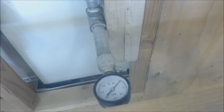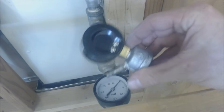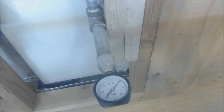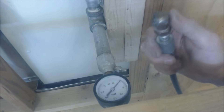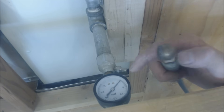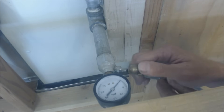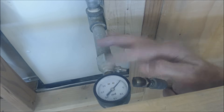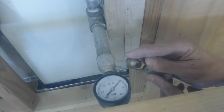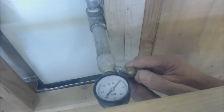Here's what one style of pressure test gauge looks like, and here's a different style. We're going to go ahead and put pressure in and see what happens. When adding air, have the air meter set down at the regulator on your air compressor — run it down to about 25 PSIG. If you blow 100 PSIG in, you can damage your gauge. With it set at about 25 PSIG coming in and a target of six PSIG, you'll just need to watch how fast the pressure builds.